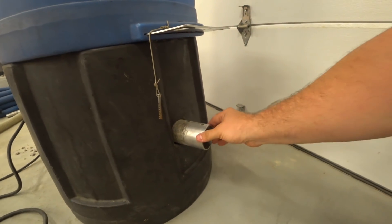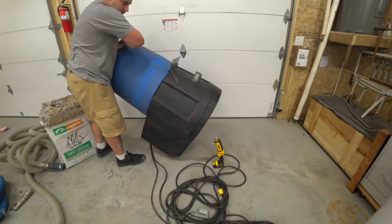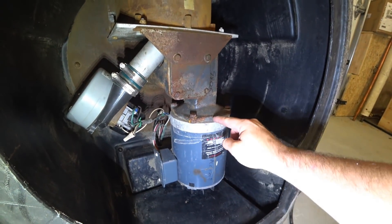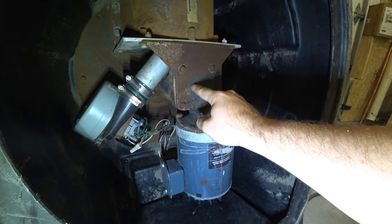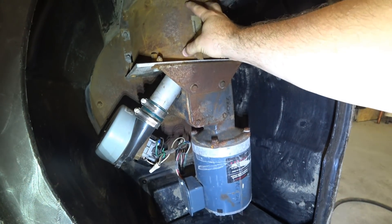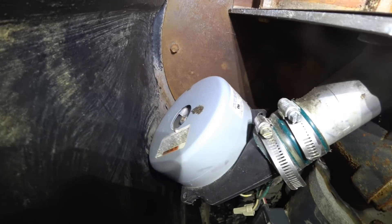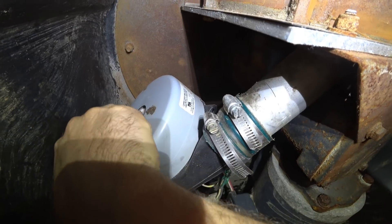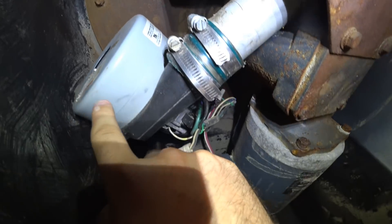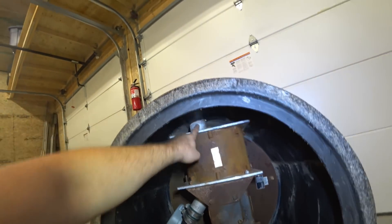Under the feed gate is the port — that's where your hose is going to hook up to, and your insulation is actually going to come out from here. We can look inside. This big motor is turning a shaft, running a gearbox. Inside the gearbox, it's going to split — it's going to be turning the airlock, and it's going to turn the agitator inside, that big propeller-looking thing. This blower is going to suck air in here — you can actually see that turn — and then blow it. The air is going to come in here into the airlock, and then blow out the port right here.